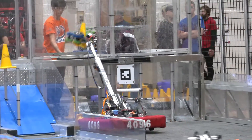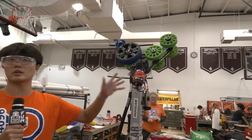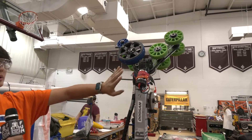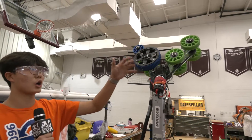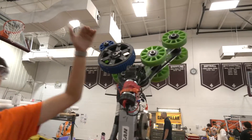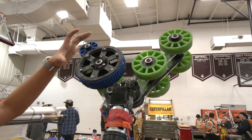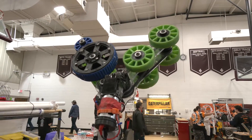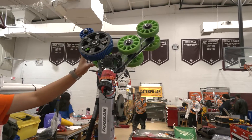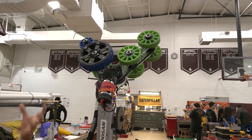Let's wrap up on your robot — pass it back to Aiden. Talk about your intake here; I'm really curious about the wheel configuration. So the name of the game for us this year was being simple — we want to get our drive team as much practice as possible in our shop. Our intake features eight wheels with a current sensor to let our robot know that a cone or cube is inside when it's logged. The big wheel is for cones — when a cone comes in, we pinch it through and keep it really secure. The problem with having another green wheel was that the gap would be a bit too big. With our cube, since it's a bit fatter and wouldn't pinch through, we just place it on top and the current sensor lets us know. We knew we wanted a V design because that would work for both cones and cubes, and we brought in the modified wheel later when we figured out the original configuration wasn't working as confidently as we wanted.